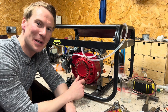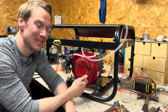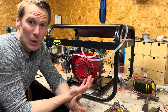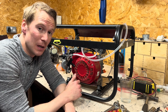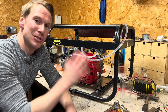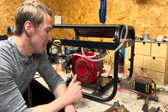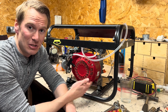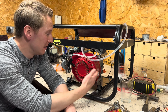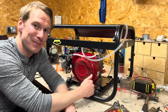So that's the engine complete and now ready to go on a go-kart. I've just shown you it running on pure hydrogen gas and then with a water-methanol mix. It doesn't have to run on water-methanol mix — it could just be water, or just hydrogen gas with no liquid whatsoever. That liquid is just for exhaust port and intake port cooling. The methanol in there is just to give it a little bit of a kick because, again, this is for a go-kart — a racing application. But there we go, we've proven it works. Till next time. Cheerio.